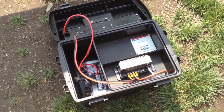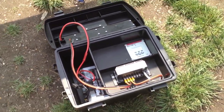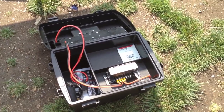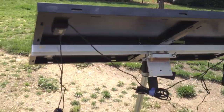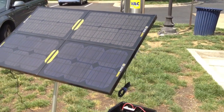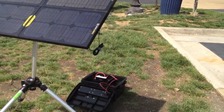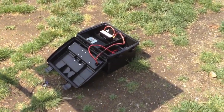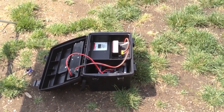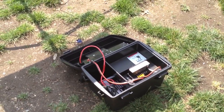Of course, normally with this I would have a lot of jumper cables and different things to hook my setup to. If you have any questions, please let me know — I've very much enjoyed building this. The first version of this box was just a Group 1 power box sold at an auto parts store, made to hold a 33 amp hour battery. The biggest upgrade I've made besides the box itself is the batteries — going from that 33 amp hour battery, which on a 1 amp draw down to 11.8 volts gave me about 22 amp hours, to the 40 amp hour setup which gave me 30 amp hours. That was an unexpected bonus, even though the batteries were more expensive than I would have liked. Anyway, take care — 73.